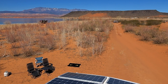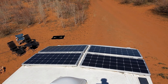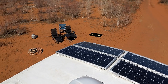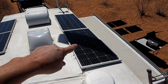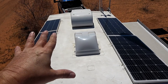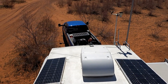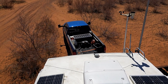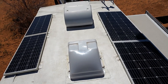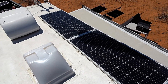Let's start up on the roof. At the front of the fifth wheel I have four 100-watt Renogy panels — the earliest system components I installed, used for many years and still there. On the back I've since added two 170-watt Bouges RV panels and two more 100-watt Renogy panels. That's 540 watts at the back and 400 watts at the front. I can also plug in a panel on the truck to make it 500 watts, so I can have over a thousand watts coming off the roof. All these are wired in parallel so shading one panel doesn't affect the others.